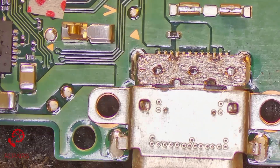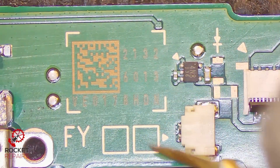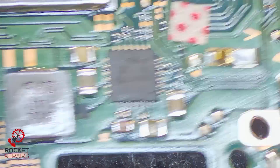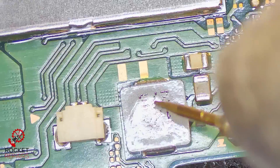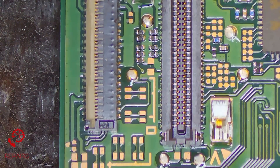That's the BQ charging IC - it's a little bit different on the OLED versions of the Nintendo Switch. We've got the charging port here. Usually the BQ charging IC is here, but on this board it's over to the left. There's just a little bit of stickiness on the thermal pad that sits on top of it. If we go over to the left even further we've got a MAX IC, and the board layout is completely different to that of the Nintendo Switch.